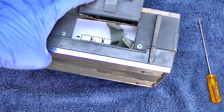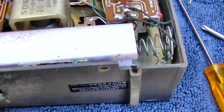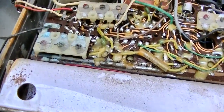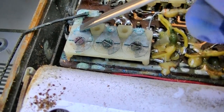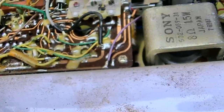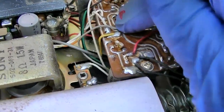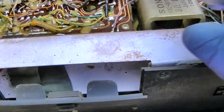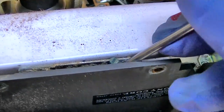Let's open her up and see how baked out and corroded she is. There's a little bit of corrosion here — maybe more than a little bit. In a previous video I mentioned that Sony made their own transistors, and right there is an example of what I was talking about. It looks like it's separated out: audio amp, IF, RF — so front end, IF, audio out.